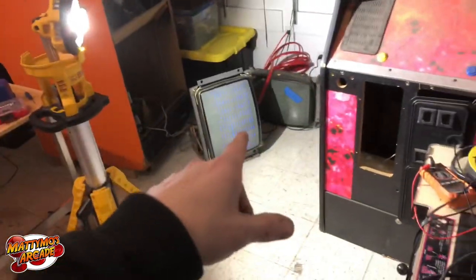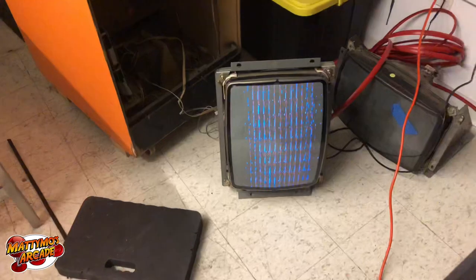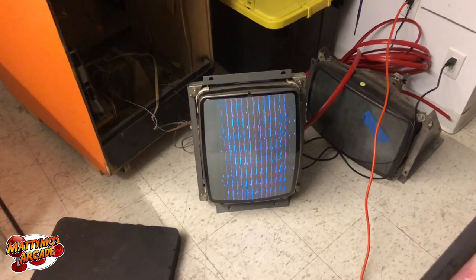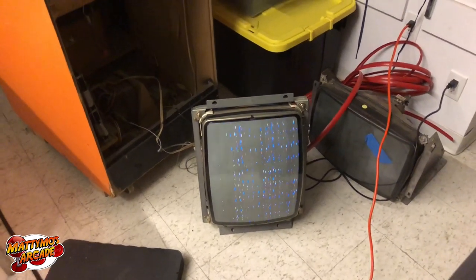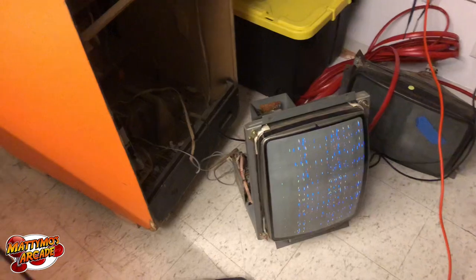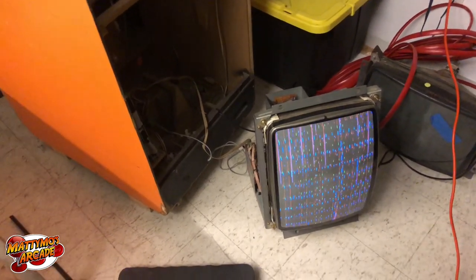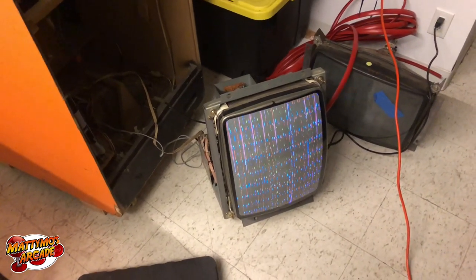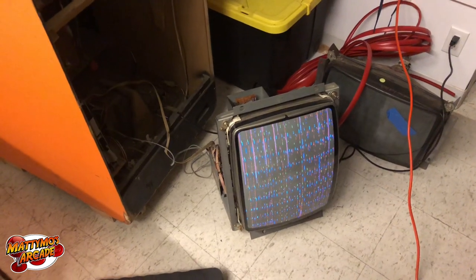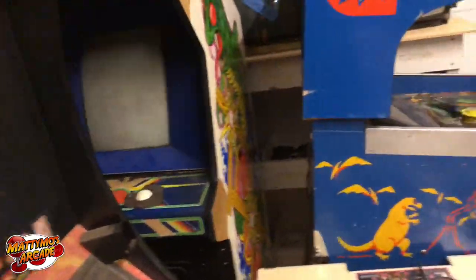We got another extra board set that works, but stick around — I'm gonna see if I can't fix this part real quick and then we'll look at the other games. No luck — looks like we have maybe more color, more image, but not any better. I'm gonna test the voltages again at the board and at the power supply, and also try the Donkey Kong board in there. It's a four-board stack — they both have the weird connectors on the side rather than the edge connector. I want to see if maybe it's a cabinet issue or a board issue, if the board could have been flexed. I had the board working a few months ago — I think it just had graphic glitches — but we'll have to dig into that more.